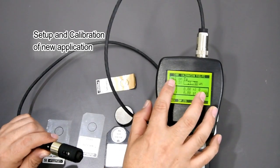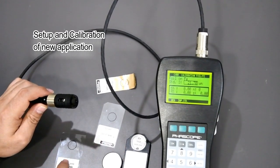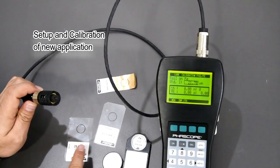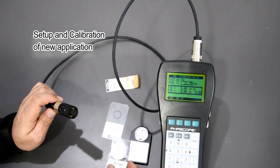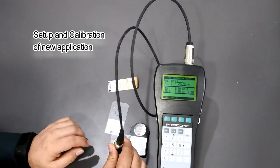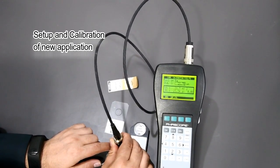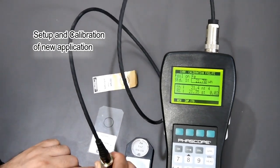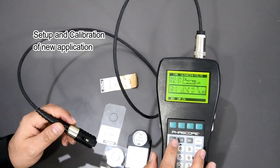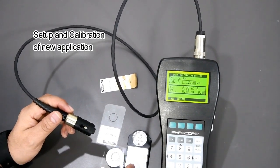Pressing OK, it's asking me for foil number one on the base. I have two foils here — 21.7 microns and 122 microns. The first foil is 21.7 microns, so I will keep it on the base and take again five readings. I press OK and it asks me for the second foil.